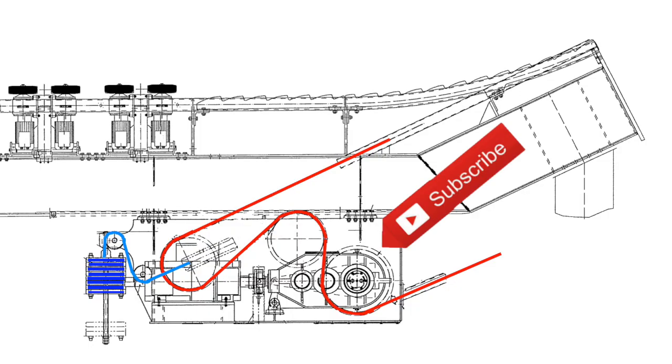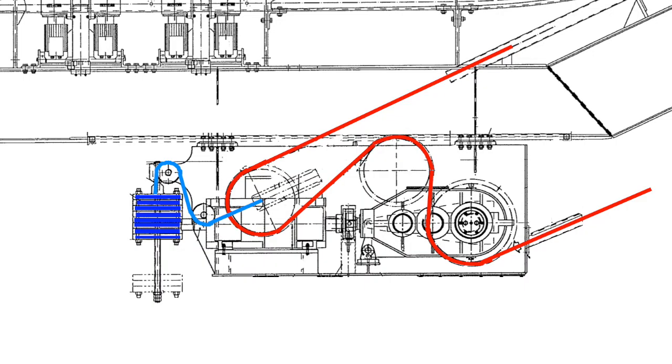So then you go down the lift hill, and I'll go over something like a B&M ride first. So you go down the lift hill, and then the first sprocket it meets down there is the one that the lift motor is turning. So the one that the lift motor turns is called the bull wheel. That's just a term that they gave to it. So the chain comes down, it goes over the bull wheel, and then it goes up and over some more sprockets on the inside until it gets to a tensioner sprocket. The tensioner sprocket is what pulls weight down on the entire assembly to keep the chain tight. Again, these are all terms, they're interchangeable, and it depends on how the manufacturer has set the ride up.